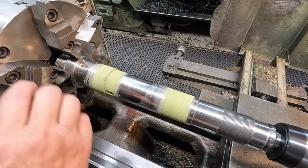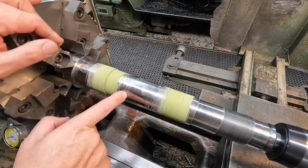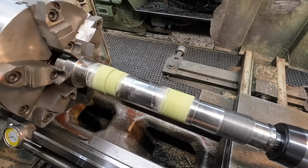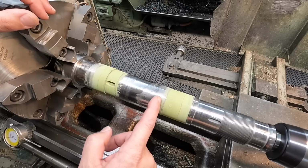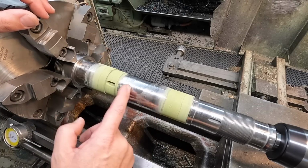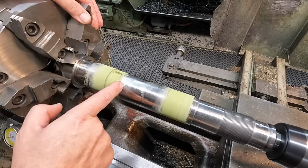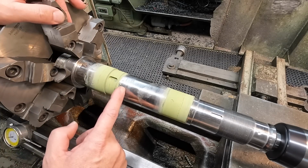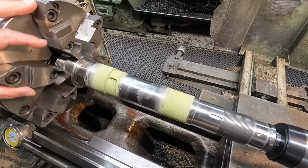Plus, it's going to clean up all these gouge spots in there where it galled. We're going to get all those out and make sure it's all cleaned up nice and well. So next phase from here, now that we've got it masked, we're going to set up a tool and undercut this approximately 20 thousandths. And if the area where these spots are is not cleaned up, we'll only isolate our cut in that one area to get these low spots cleaned up.